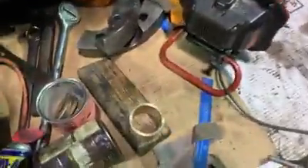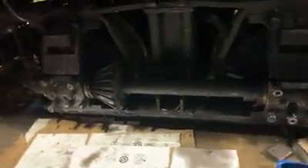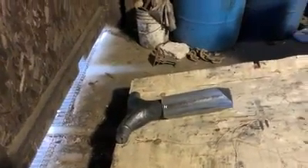Underneath the locomotive you can see the other coupling ring that'll go on this side. Up here in front there's a brass sleeve — pick this up. That's going to go right there. Nice smooth fit. Put a little bit of grease to hold it in there, and that'll keep it in place. Through these holes up on the top is where it gets its lubrication each day the locomotive runs. The line shaft is all in place, bearings are all there, boxes have all been bolted up. All the way over on the back you can see one little piece left — the other half of that universal that attaches from the crankshaft to the truck underneath the cab.